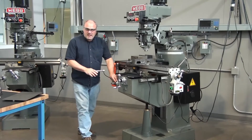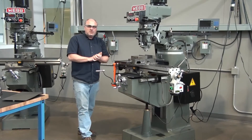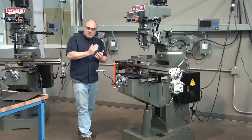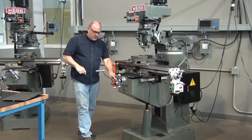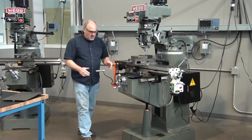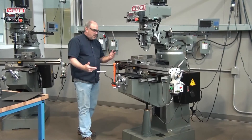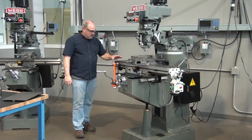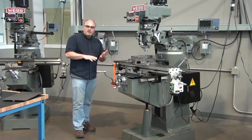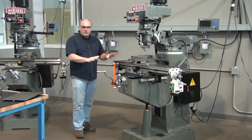Those little segments — how do we know how to measure them? We measure a part using a set of calipers. Calipers have graduations on them too. Each little segment on a dial caliper is one thousandth of an inch. So you measure a thousandth, you see a thousandth on the machine. If you need to take ten thousandths more off, you move it ten thousandths. Micrometers are the same way — divided in thousandths. They all correspond with your measuring equipment, which makes it really simple.